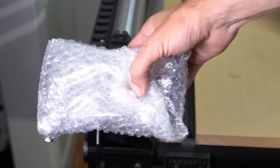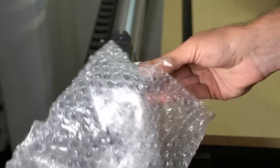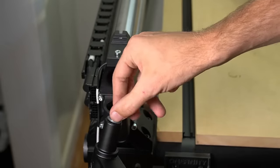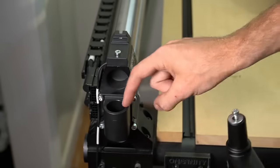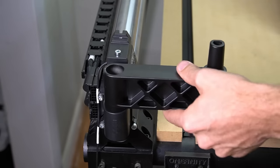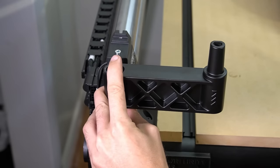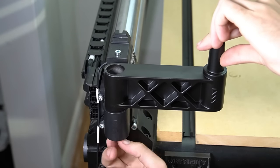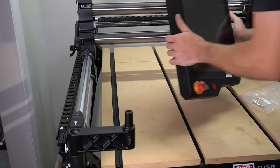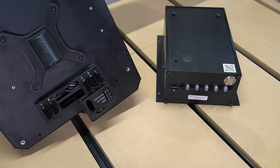Moving back to the front of our Y1 rail, we're going to install our Masso mounting arm. This is the aluminum mounting arm that will be in the bubble wrap packaging. It will come pre-installed with the bolt and a washer threaded in the bottom of it. We're going to remove these and thread this through the bottom of the cup-like mount that we've already installed on the front of our Y1 rail — this will prevent the Masso mounting arm from coming loose and falling out of the mount. Place the mounting arm thread-side down inside of the cup, then place the bolt with the washer pre-installed through this and secure that with a four millimeter hex key. With that mounting arm installed, we're just going to take our Masso controller and slide it onto this mount. It will sit in place and gravity will hold it onto the mounting arm. It also swivels freely at two points.